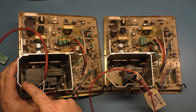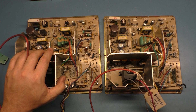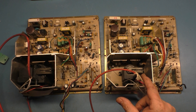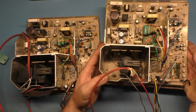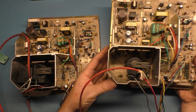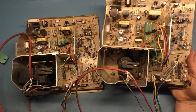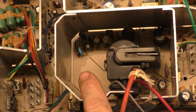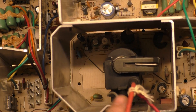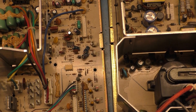This one here is completely intact, not a single hint of a crack at all, so I'm not going to worry about that. These work perfectly, but this one obviously must have had problems because they replaced it. Look at the footprint of this one compared to this one — it's crazy. This works fine and you can see the old footprint went all the way out to here. This whole area isn't even used, so this flyback apparently is a valid replacement for this model of chassis.